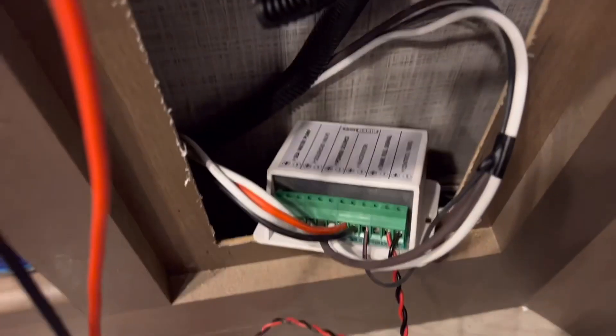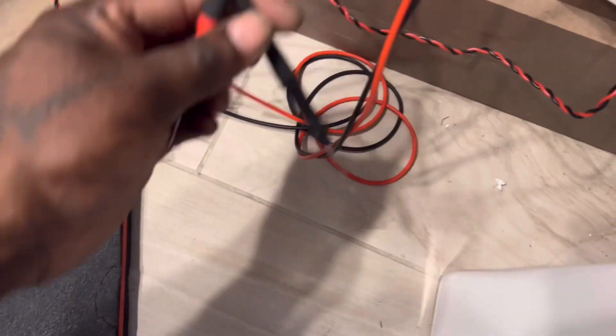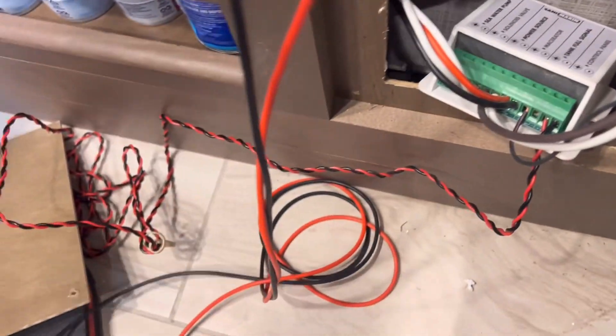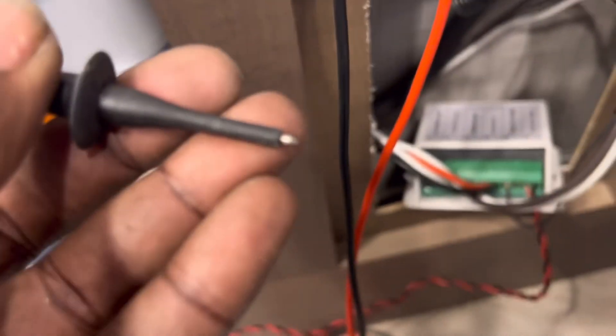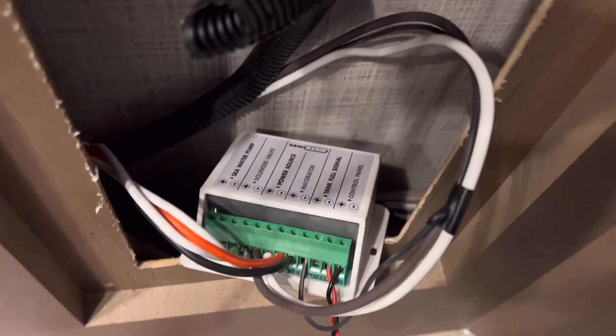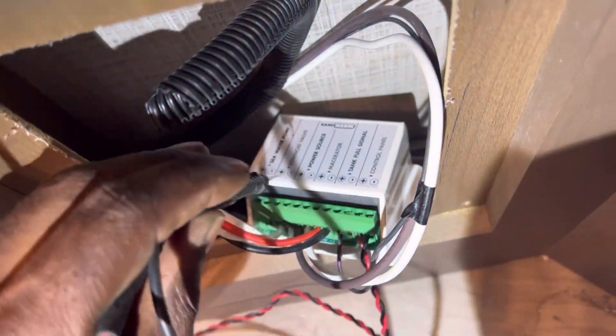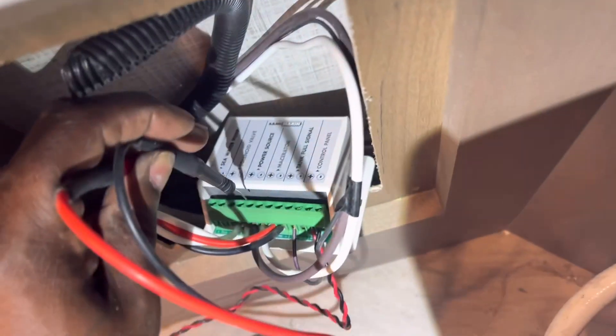I don't have proper voltage - I'm getting low voltage. I had to switch to the very fine point leads on here because the regular Fluke leads with that CAT rating have plastic that gets in the way. So I used my back-probing lead and I was only getting about two to two and a half volts.